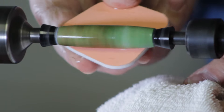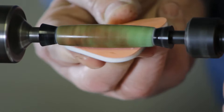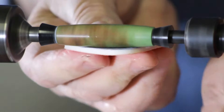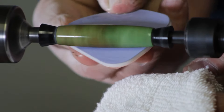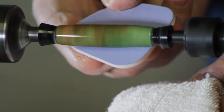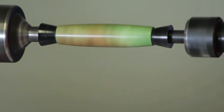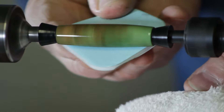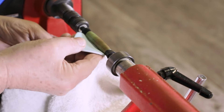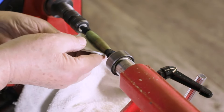This is 1500 grit. I want to get a nice little slurry on here — that's that white stuff you see right there. Wipe this off, wipe the pad off, dip it in again. This is 2400 grit. Each time they get finer as you go up the ladder with grits — the scratches get finer and finer. Now this is 4000, and the next one's going to be 12000. Wipe this off, come back, and do the 12000 pad.